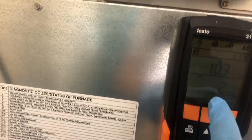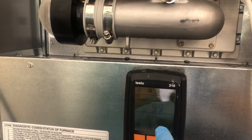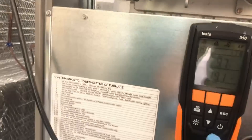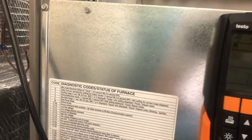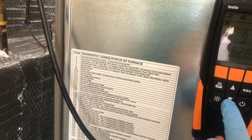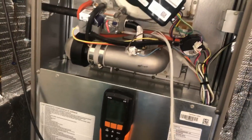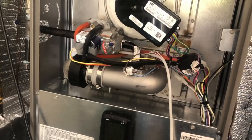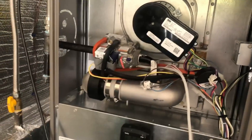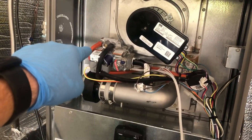The display is showing our carbon monoxide reading — we got 2 parts per million. Scrolling down shows our efficiency: it's an 80.2% efficient unit, right about where we want it. Our excess air is at 76.7%. For CO2 we want 6.5 to 7.5 percent, but right now we're at 6.28, so it's a little low. One adjustment is cleaning combustion air vents for more air, but we're in a garage with the door wide open which may be affecting it, so we'll try giving a little more gas.